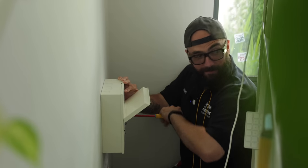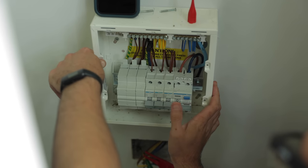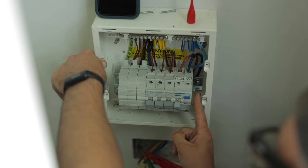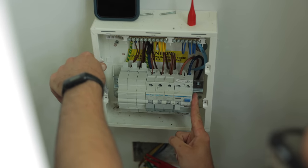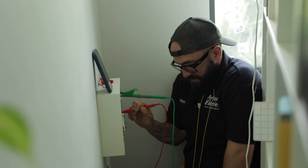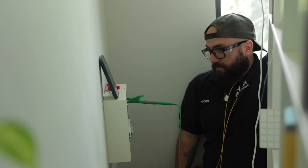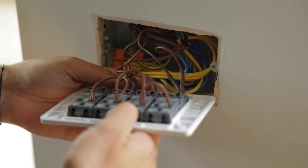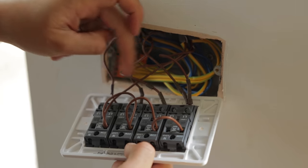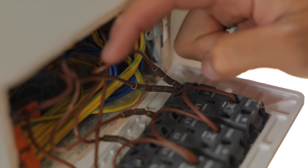So this is our office DB — it's actually in quite good condition. It's got a type A RCD, one ring, an AC circuit and lights — pretty straightforward. The interesting thing would be the volt drop to this point because it's fed from the garage, which is fed from the swimming pool, which is fed from the house — quite a long run, about 240 meters. Someone's gone to all the effort of cutting, sleeving, and marking up one, two, three, four — and they're both four. Ever heard of a Sharpie?